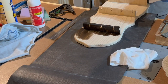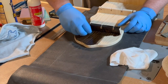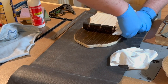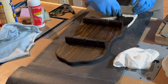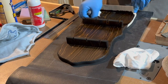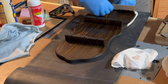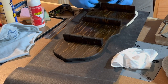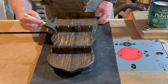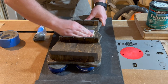Now that it's all put together, the final thing to do is stain and finish it. I'm using a walnut stain because the silver spoons will really stand out against this dark background. I use a rag to apply the stain throughout the whole board, into the little crevices of the spoon holders, the shelf, and the back. I let it sit for about five minutes and then wipe it off with a clean rag to avoid dark splotchy patterns. I flatten those rags out and put them on the garage floor to dry overnight — we don't want any fires.